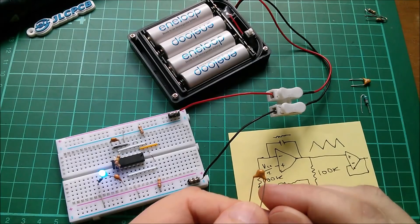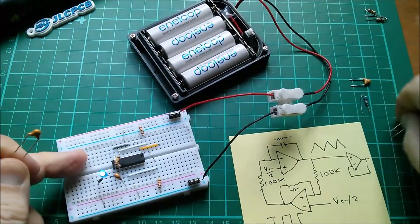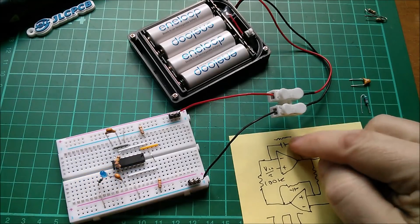With just two resistors and two capacitors it works! Then I thought, let's have some big capacitors. This tall one standing up is a 106 — let's make this thing go really slow. And now you can see it fading in and out really slowly. By having a capacitor in both of these op-amps I managed to slow this thing right down.